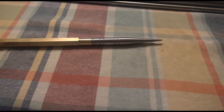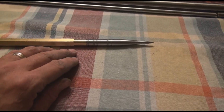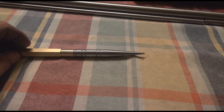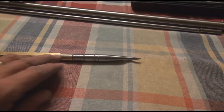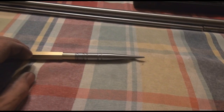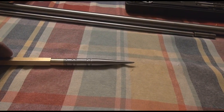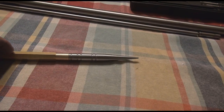I'm making a little more progress. This is the hex stock I've got. I finished it off, tapped it, threaded it, and now I've got to part it off probably in here — right at the end of the threads. I'm going to do some decorative cuts, drill a hole all the way through. I'm not sure whether to scallop this or put the hole here. That way I can put that special pin in, and then I've got to make the holder for the whole thing so that it all ties together.